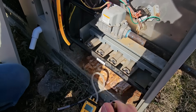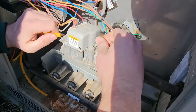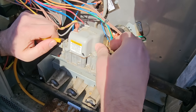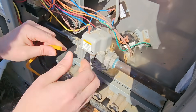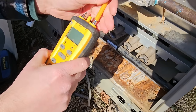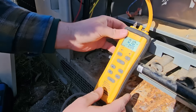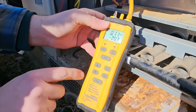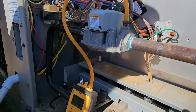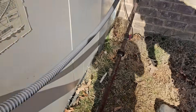I've got this little barb fitting right here. I'm going to screw this barb fitting in, then hook up the tube on one of the ports for the manometer. Set it right here and zero it out. Now let's go ahead and turn the gas supply back on and see what we get.